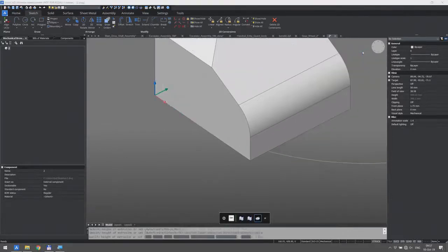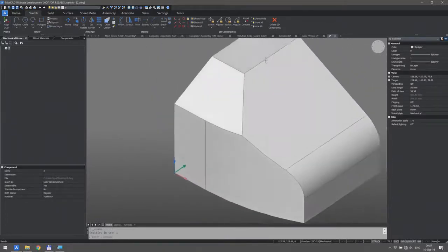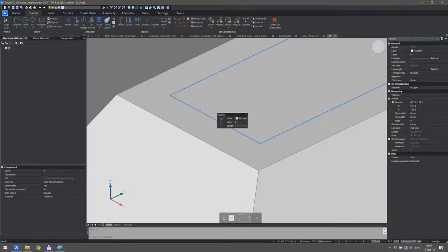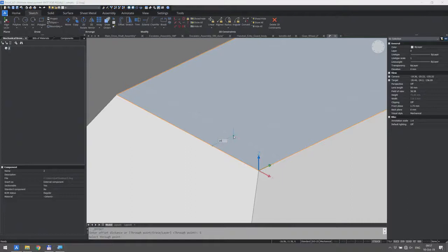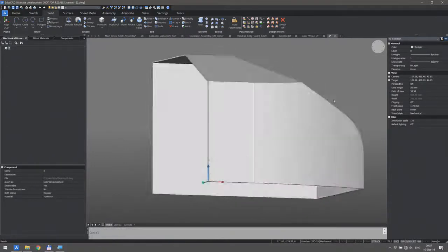And it's important to notice that we got two cylinders crossing themselves. You will see that it's important for the next step. Then we'll create the necessary holes in this model. Then we will shell to get something with the same thickness everywhere.